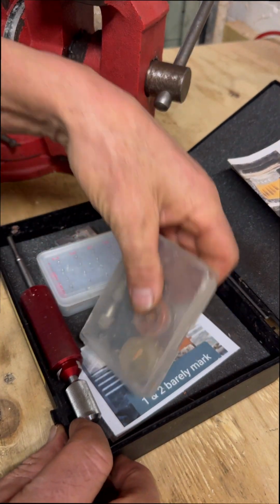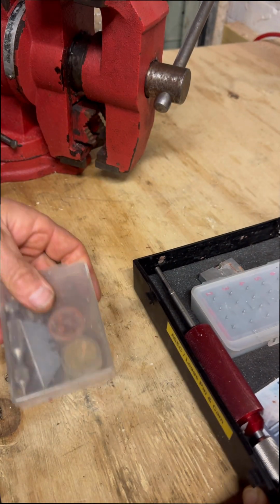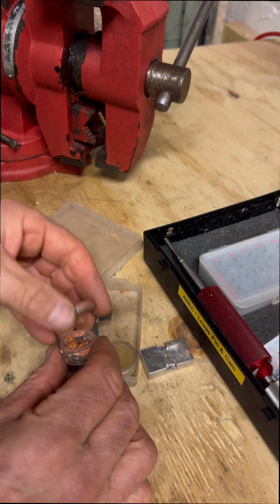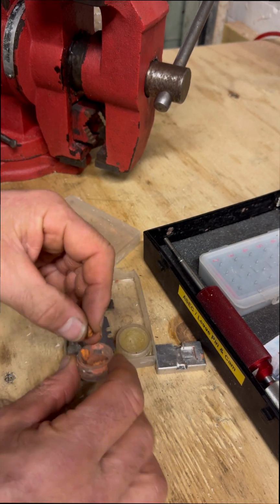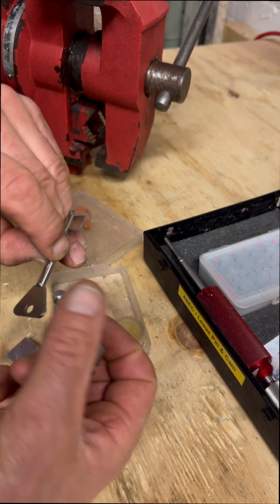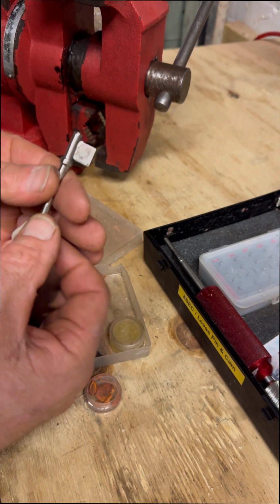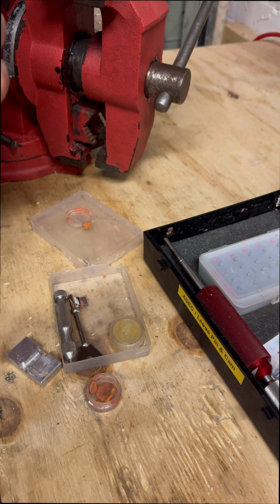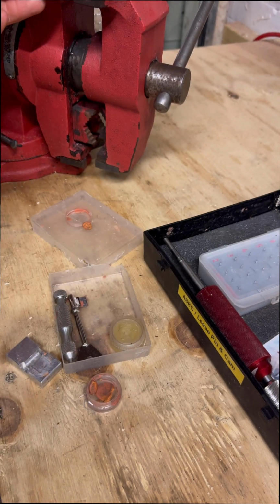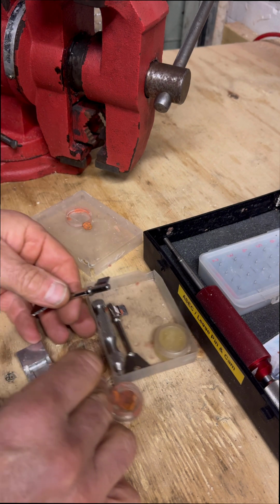here. And the first thing to do is to prepare a reader key. It's a bit cold in here and plasticine doesn't do too well in the cold, but we'll give it a go. What I like to do, I've got a scalpel blade. You take a reading from the back of the levers. So in this particular case, we need the key with the cutout that allows us to read the back of the levers on the right.